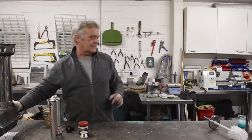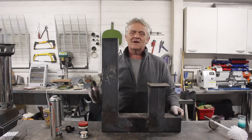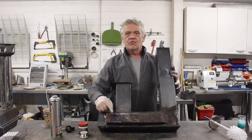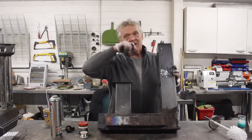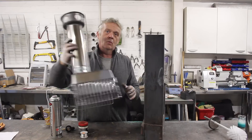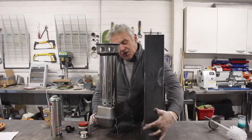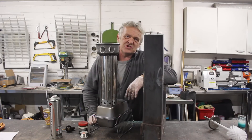Back in the old days when I was slavishly following everybody else's ideas, I made this. It works because it was made to someone else's plan, not mine. I introduced this which draws air along here, preheats it in this chamber, there's a little hole in here, and it does add a bit of extra oxygen — but it begs the question: how much better would it be if I replicated this? So what I'm going to do is drill a lot of holes around the bottom here to replicate those holes, light it, and see what we get.